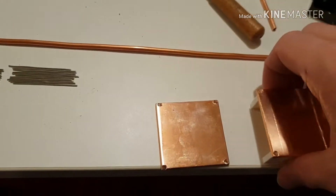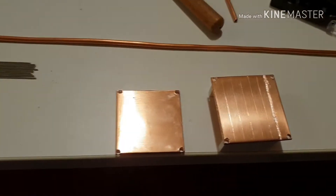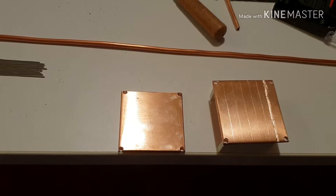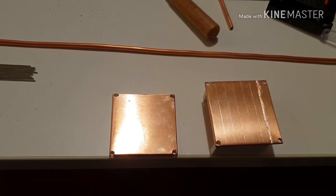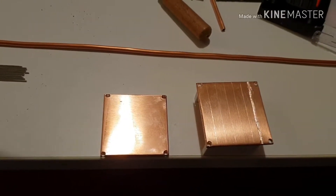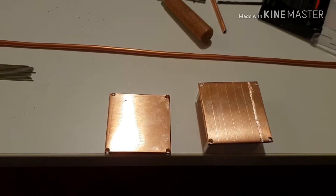The whole thing will be pumped using a peristaltic pump. Peristaltic pumps have the advantage that they are constant displacement, so we'll be able to very tightly control the speed that the drink goes through, and that should be directly proportional to the output temperature — the slower the speed, the colder the output temperature. We should be able to tune the system by balancing how much power the Peltiers are driven with versus how much liquid is going through the system.